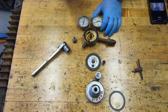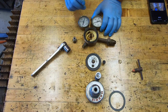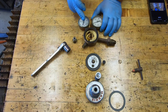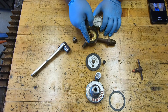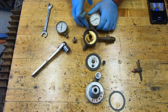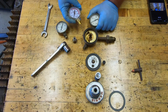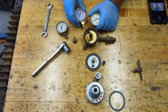I can chuck this up in the vice if I have to. Especially at this point, if you have to chuck it up in the vice to remove your gauge, be extra careful because you don't want to mar up this surface here. Whenever I replace any gauges, I always like to do a quick dry fit before I put any sealant on my threads.